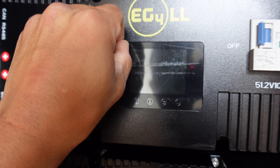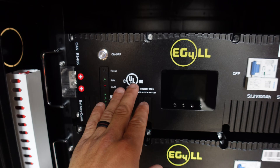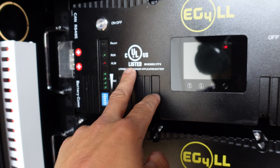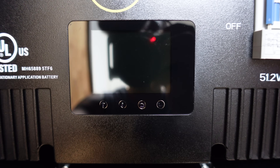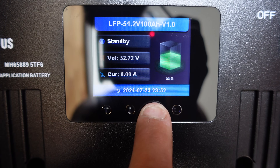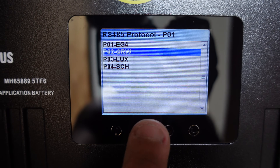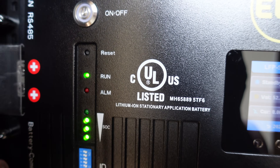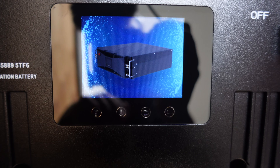Now I want to teach you guys how to set up one of these batteries. We're going to peel this off so you can see the screen. We have to set this thing up for LUX Power — the 6000XP runs off of LUX Power tech. So keeping the breaker off, we're going to put all the DIP switches into programming mode — all over to the right side — then turn the battery on. Once it boots up, we're going to hold the return button for five seconds to get into settings, navigate to the RS485 protocol settings, hit enter, and go down to LUX Power P03-LUX. Hit enter, go back, then power cycle the battery.